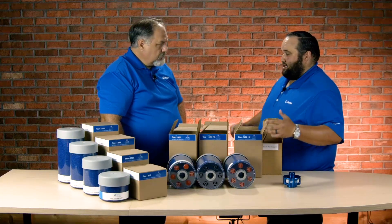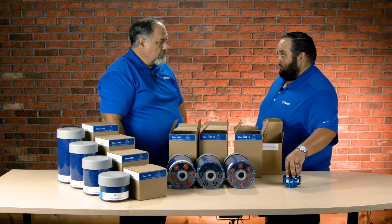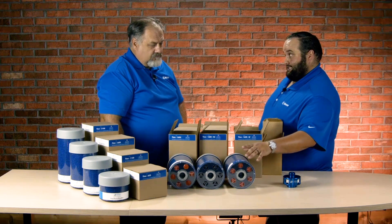Are these a one-time install or low maintenance? Desiccant breathers, by virtue, are consumables — they will get used up and become saturated. Depending on the check valves, you can get longer life out of them. The Smart Flow adapter is a one-time install on the machine, but you do have to change out the desiccants.